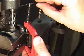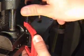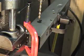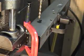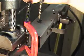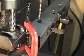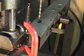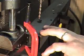Just don't be in a hurry when you do this stuff. The rear trunnion on an AKM uses an 11/64ths bit — it's a 3/16ths but I like to undersize it a little bit; if I need to widen it out I can. If this were an underfolder or a side folder, it's a 5/32nds bit. The trick is: if you're using a short rivet it's a small size, if it's a long rivet it's a larger size.